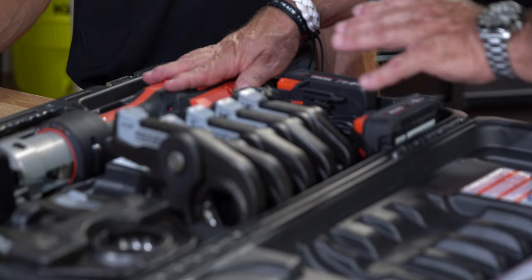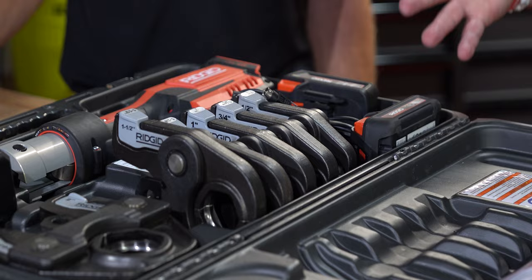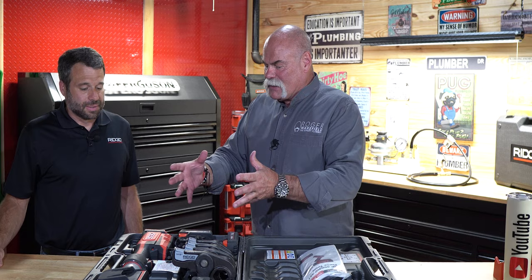So if someone's doing carbon steel, they'd go to a Megapress jaw instead of a ProPress jaw — absolutely. What is the future of soldering? As much as we'd love everybody to transition to press connections, we know that's not going to be the case anytime soon. There will always be an application for soldering. However, this is an extremely versatile tool and it's going to make you transition away from soldering in most applications.